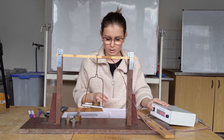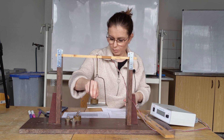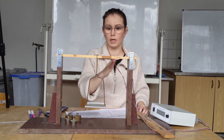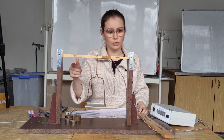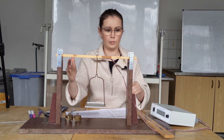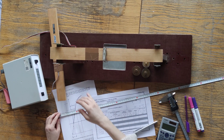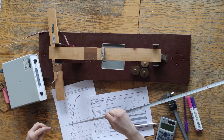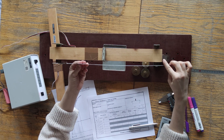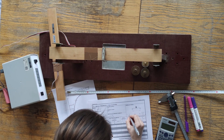At this moment we can turn off the measuring station and measure the other required dimensions needed to calculate the modulus of elasticity. After the first measurement, we need to measure the geometry of the tested specimen. The first thing of interest is the span between the supports. The specimen is positioned at the midpoint between the two supports, so I will measure the middle section plus the width of one support. The value is 35 cm — converted to millimeters for the protocol, that is 350 mm.